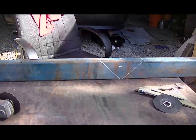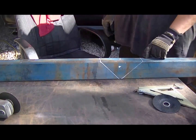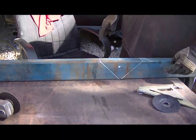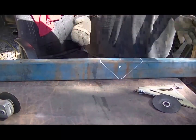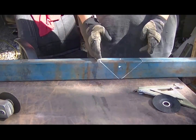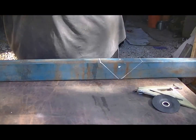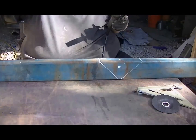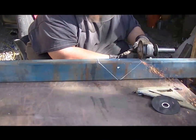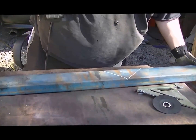After cutting out the top portion of your V notch, you're going to want to take your straight edge and a marker and do your top parts and then your back parts. Don't cut out the back part, because you can use it to bend it straight to a perfect V onto itself, to be perfectly straight up and down. Now flip it and cut the top parts.